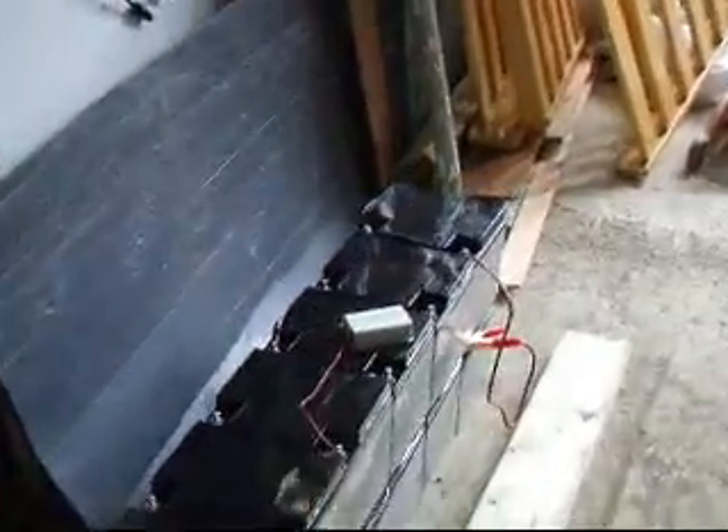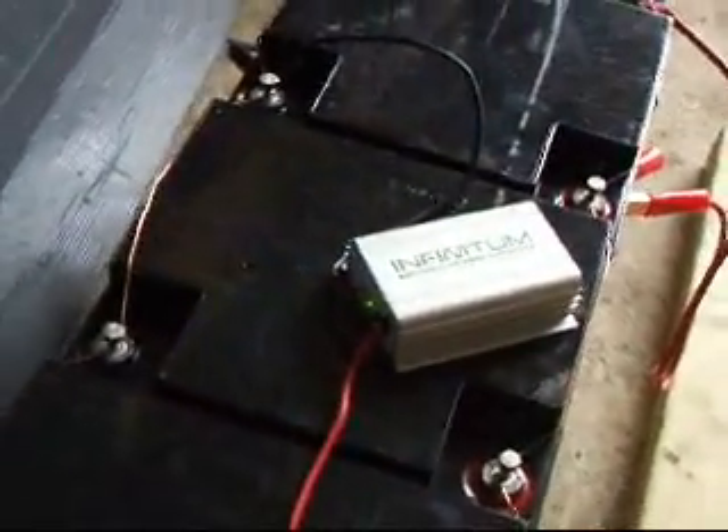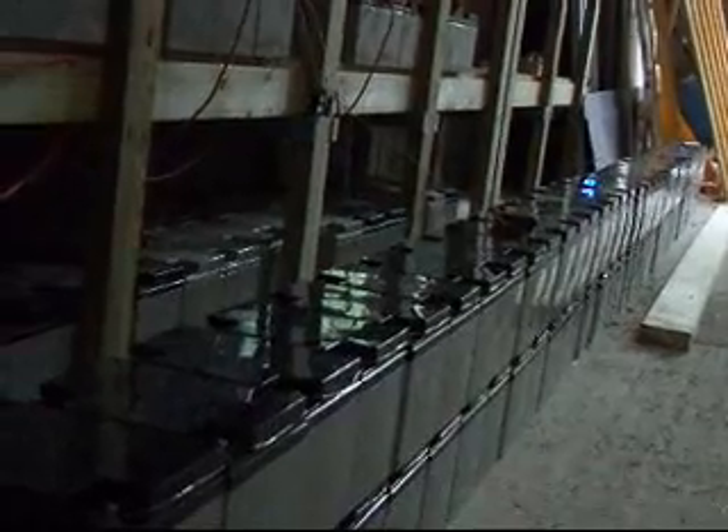When doing this, it's a good idea to put a plank on top so that you can't connect one side to the other. At the end, the top lot are connected to the bottom lot. Here I've got a commercial desulfator — I'm not sure whether it works — but the idea is that instead of feeding current between this end and that end, if you connect the positive here and the negative up there, then all of these batteries get the same charge. By connecting the two layers at that end, we can connect positive here and negative down there, and then there's an equal wire resistance going through all of the batteries.